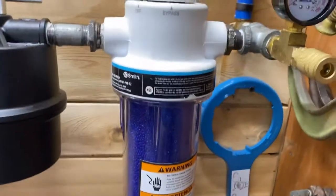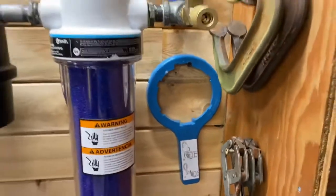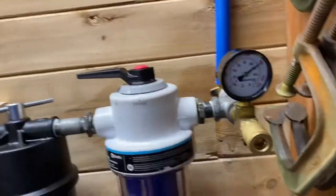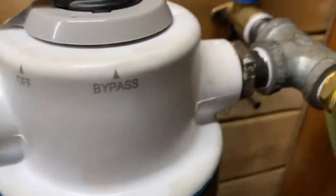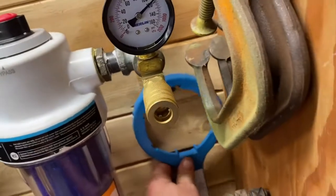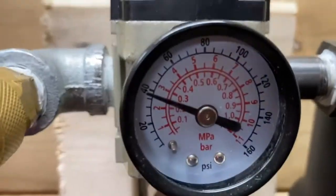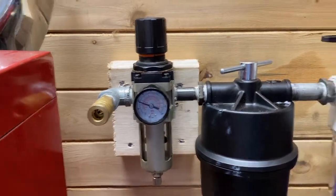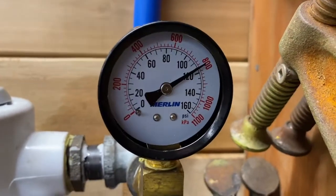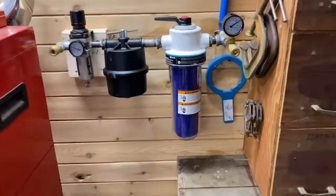Put the desiccant beads in — one quart fills it all the way up to the top perfectly. Did not know that would happen — that was nice. Put a little screw in the side to hang the wrench that you use to tighten the housing and also use to switch from filter to off to bypass if you ever need that. Here's my regulator — you can see I'm regulated down to about 37 PSI right now. I don't need to go lower than that for painting. Currently I'm at about 120 PSI with the valve open and no leaks in the system. That makes me happy.